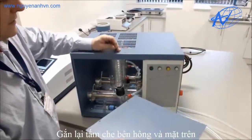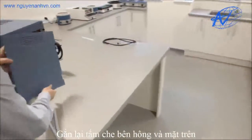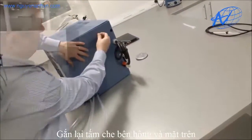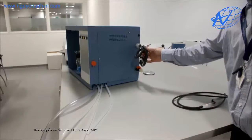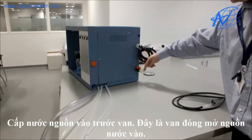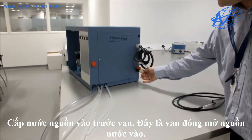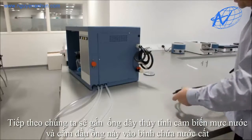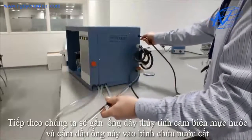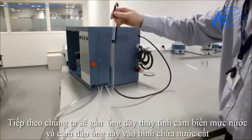The lid and the side panel can then be connected — the lid has got six screws and the rear again has got six screws holding it on. The electrics can now be connected and must be connected by a qualified electrician. The cold water can also be fitted — here you've got the mini valve assembly with the hose connected on. We then connect our reservoir water level sensor, which fits to the pressure switch connector at the top, and can then be placed inside the reservoir.